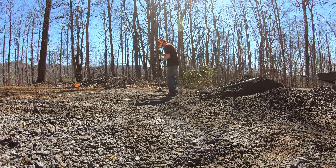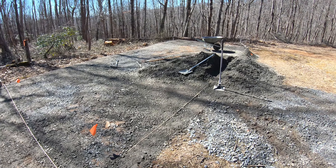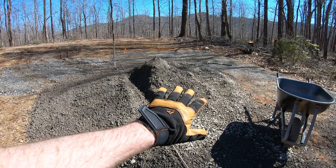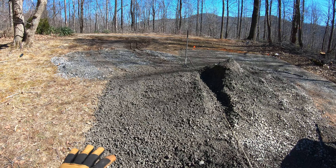That's much better. Looks like it still needs to go up maybe half an inch or an inch as it's sloping up there. I'm still going back and forth on whether I really want a pipe running underneath, but from all the rainstorms I've observed, it seems like water mostly flows through here and I might be able to divert most of it before it gets to this corner. It might be something I just have to dig out in the future — it would have been easiest to do before it all got compacted.